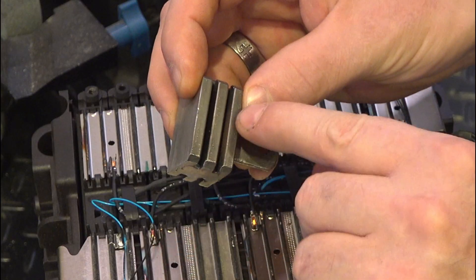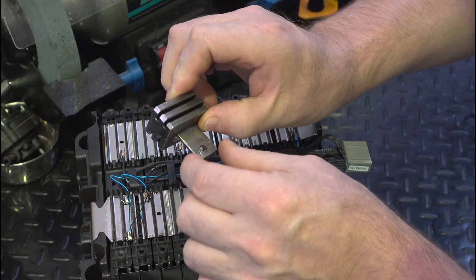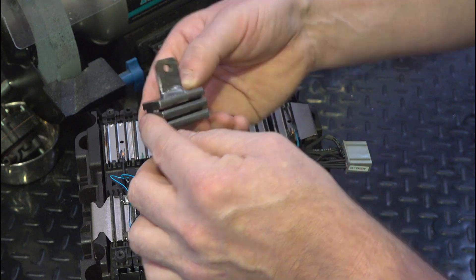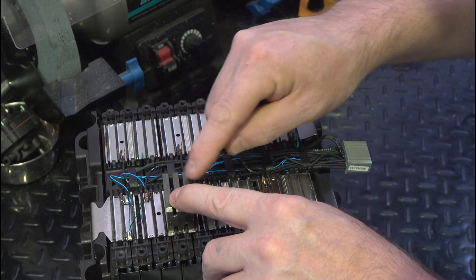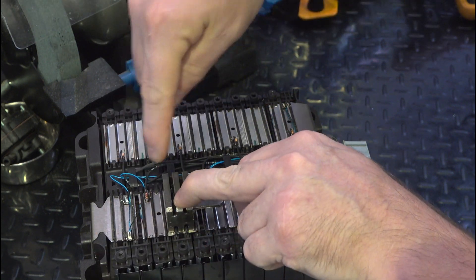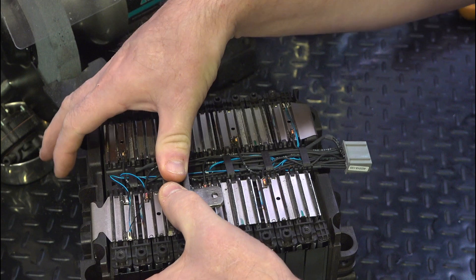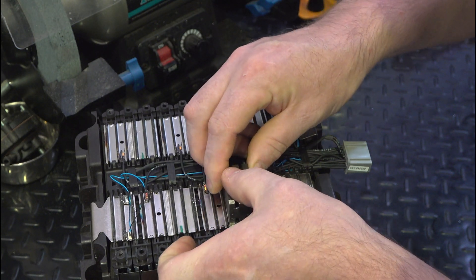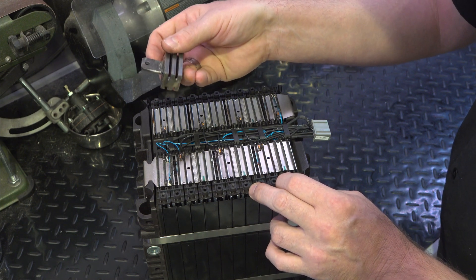Now here's what we came up with — those washers put a nice tenth-of-an-inch spacing in between, and we welded that tab on there. That's an eighth-of-an-inch thick steel, and it got these nice and flat in here. That fits really well. So now we'll get another one, put it over here, tie our high-current lines to this, and then find some way to clamp this thing down to the battery to make sure we get good contact. This is really nice — it just fits in there easily. I'll have to make four of these to test two batteries at once.